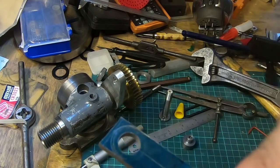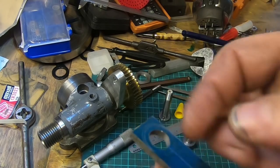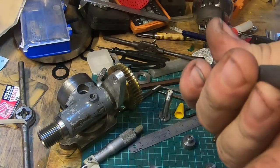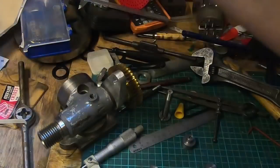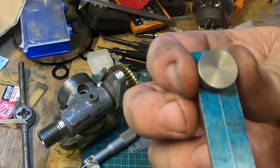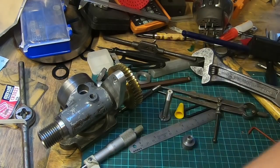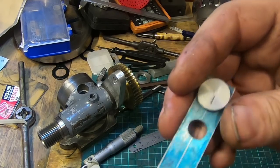I've just drilled these out to finish the slot and they're a bit undersized. I think it's about 9.2 and I'm going to clean them up to about 9.5 or so. I've made these the same diameter as this, and I've got these nicely in the centre - one for there and one for that end. This is to be tapped M8, so before we tap it we know that's going to be 6.8mm something like that.